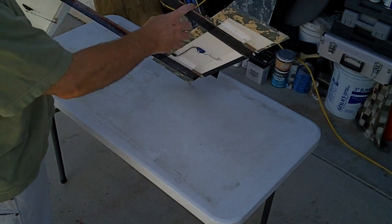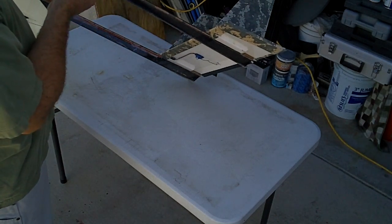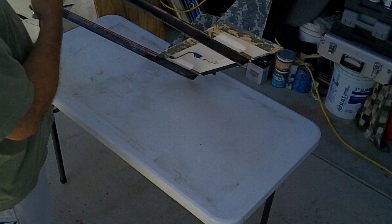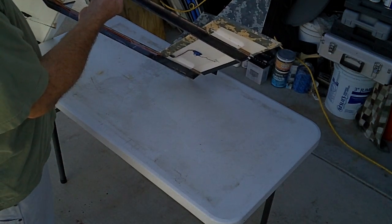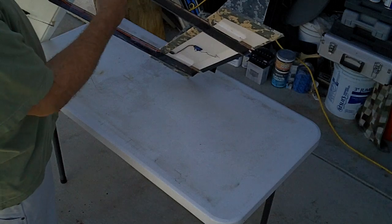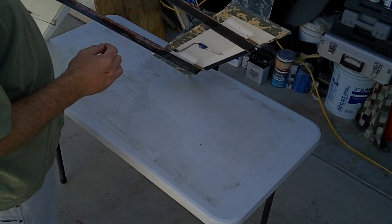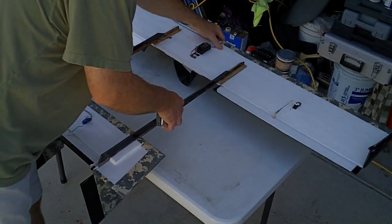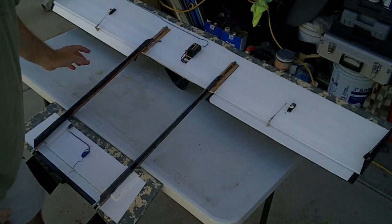And I just hot glued that on the length of. So I did the assembly and everything first, and then I put this on later. And this, of course, is all taped off. And I pre-taped all that first, and then I hot glued it to the arrow shaft. And it took all of the up-down wag, the pitch wag out of it, made it a lot more stable. Okay, so I'm thinking that's just about it for the wing and tail section.